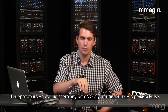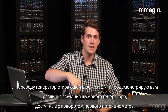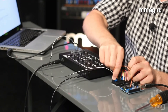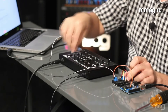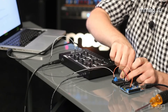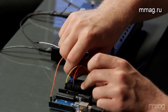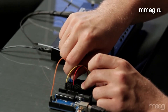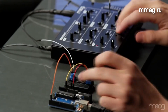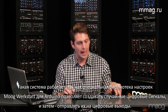This noise circuit works best with the pulse wave setting in your VCO. I'm going to turn the VCA to the on position so we can hear the difference in color as I turn the color potentiometer. You can hear as I turn this potentiometer, the color of the noise change. And as I turn the other one, you'll hear the mix change. The reason this works is because the provided Werkstatt library is creating a randomized bitstream and sending that bitstream out of digital output 1.